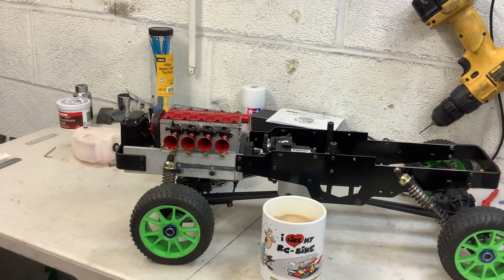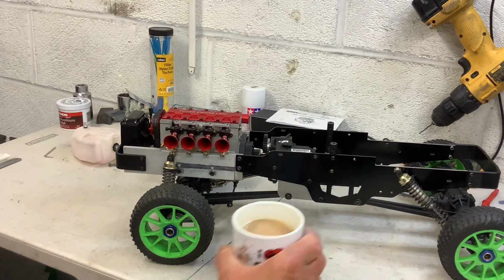Before, it was revving and had a misfire, and no matter what you did, it would sort of run, and then you think you've got it, and then it wouldn't, and it would get hot and everything. And when I saw that this morning, just one tooth out, I thought, well, maybe that is it, and I put it back how I think it is, and it's running. It's really powerful, and you can tune the needles, and it makes a difference. Whereas before, it was just pouring fuel out the exhaust, and I couldn't do much with it. So anyway, hopefully that's sorted.